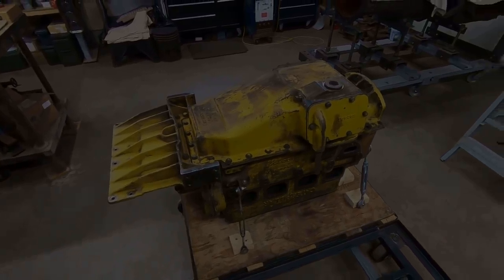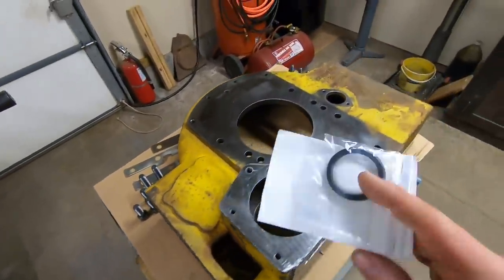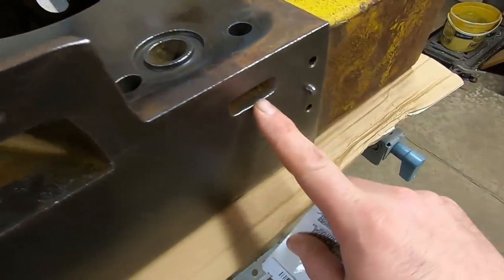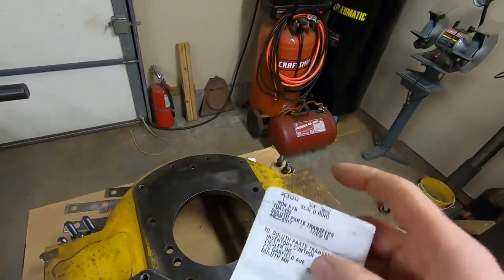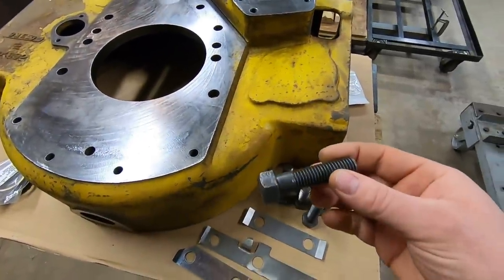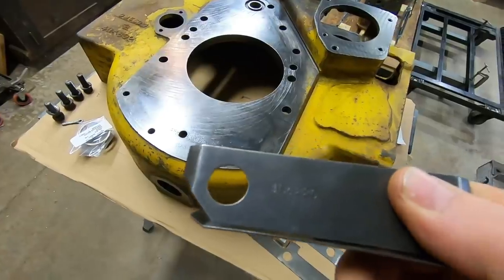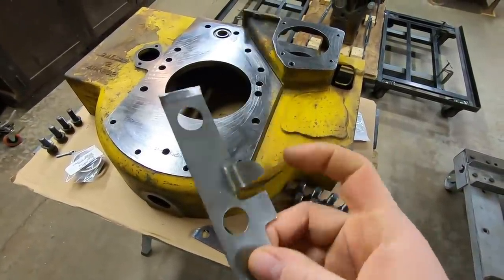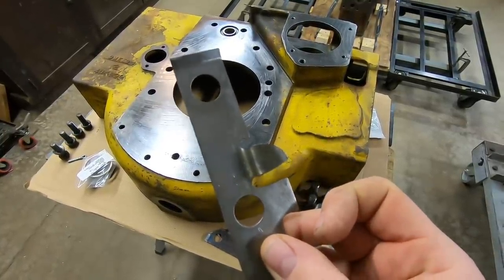As for that big bell housing - it cleaned up and checked out, everything looks good. We have an O-ring that goes in this groove and seals the water outlet on the back of the diesel block, where that channel goes into the bell housing and up through the opening into the base of the starting engine. The seal is Cat part number 5M5860. We have nine different five-eighths bolts that hold the bell housing to the engine block, and those bolts have fold-over locks under them - two of the 4B4220 locks and then one of the 4B4221s.